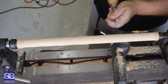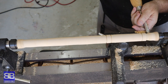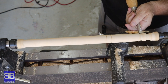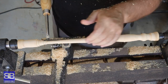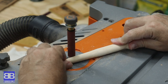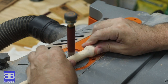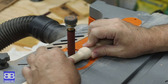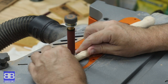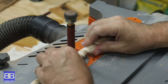Now for what I think is a really cool turned wand - well, actually the turning portion is quite basic. I've already roughly rounded it out and now I'm using the pointy tool, the round tool, and the square pants tool. I worked the blank into a very standard handle and a simple wand with no details - the details will come later. I'm using the one-half inch spindle on my oscillating spindle sander and working the wand across it as I also spin the wand. I'm as careful as I can be to stay in the same groove with each pass to sand a spiral into the wand. Because this wand is pine, it only takes a few passes but I end up with this really cool spiral wand.